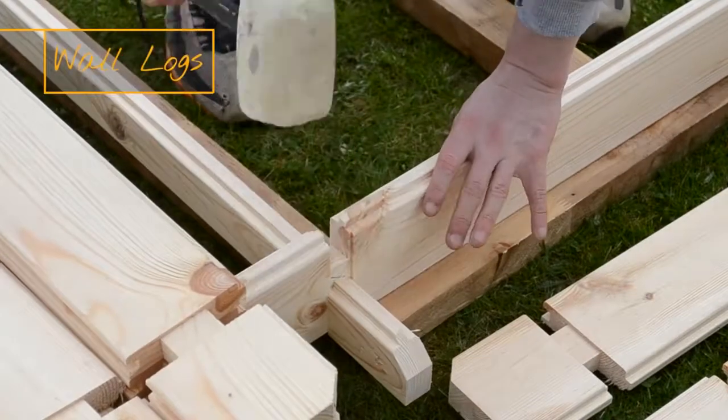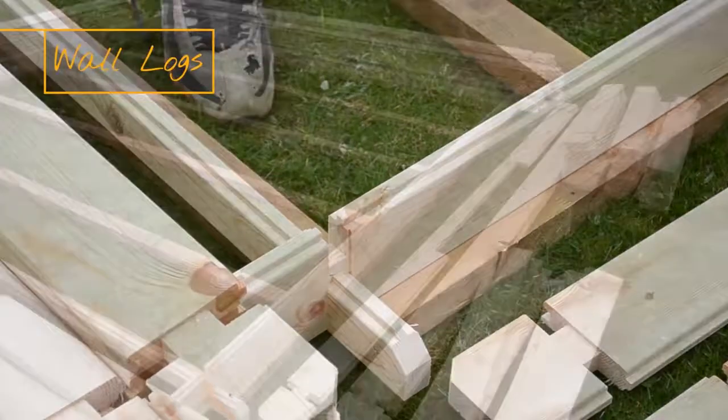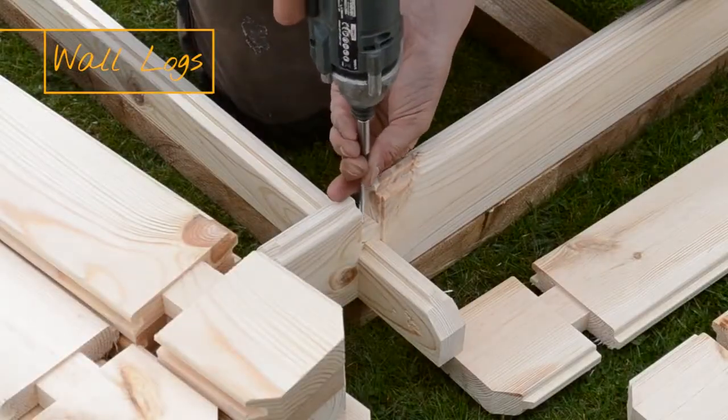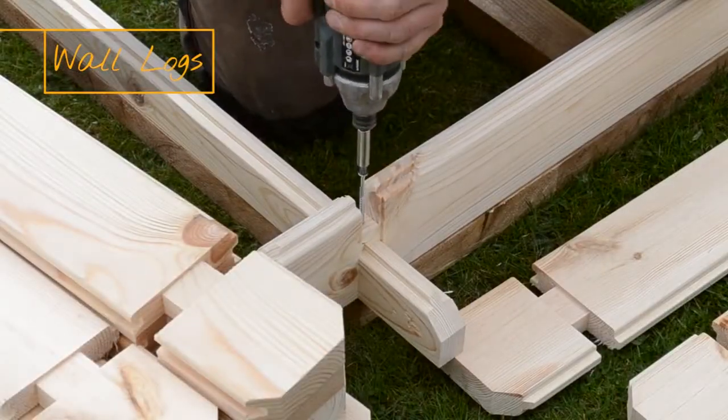Place the foundation logs for the cabin on the front and rear logs, screwing them into the bearers beneath to prevent movement. You can then begin to build up the cabin walls in even layers.